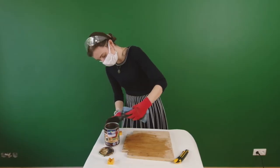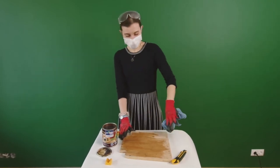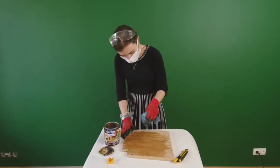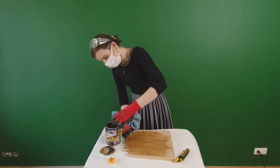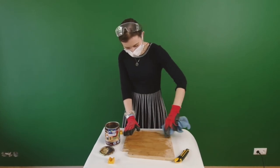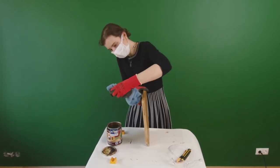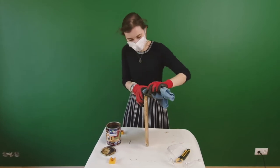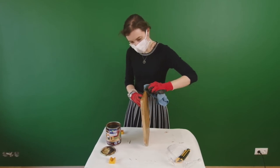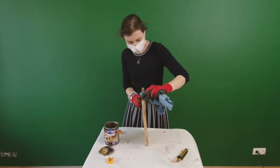It's time for my favorite part of the process, which is staining the wood. For a color, I chose walnut, which I really like — it's an ashy brown color, not yellow. It's on the dark side, but I chose to make several coats so I can control the darkness. What I learned watching several YouTube tutorials is that you have to go in the direction of the wood grain, otherwise it's very patchy and doesn't blend well.